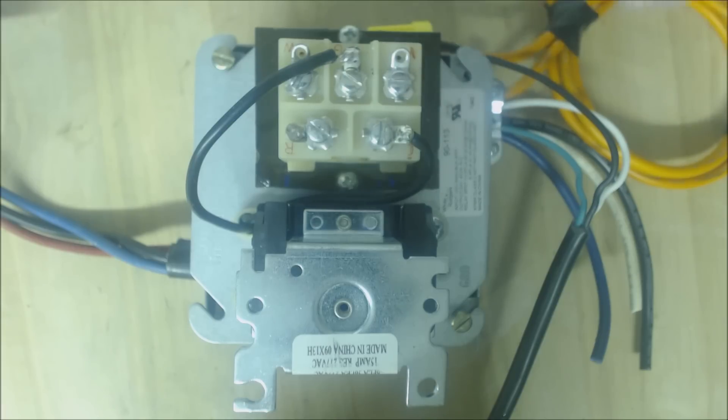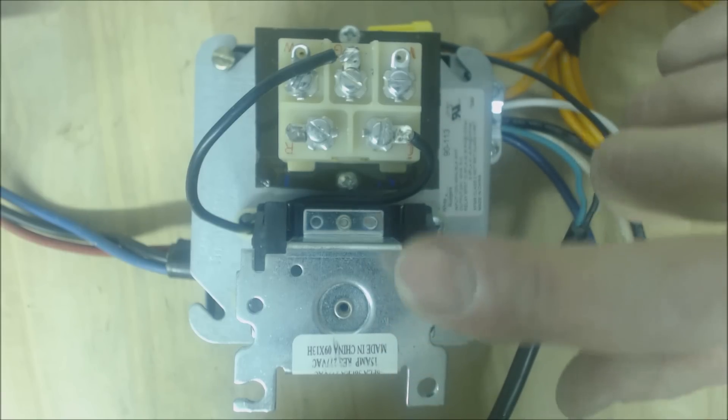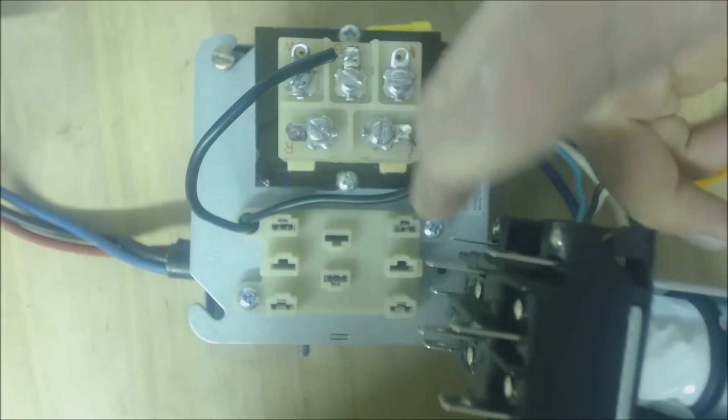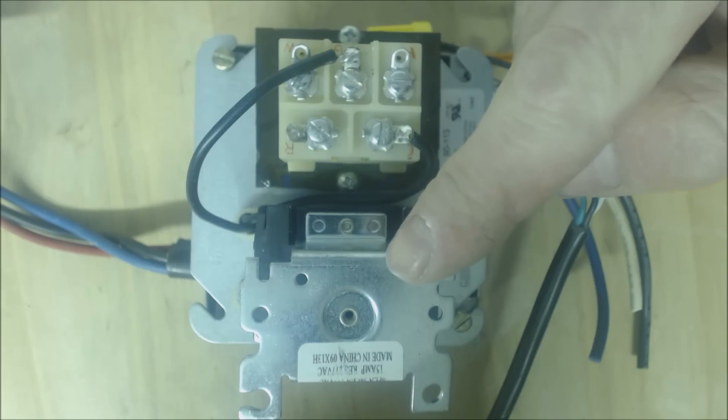This is the terminal block right here. So instead of having an IFC integrated furnace control board in earlier furnaces, this is what they used to use. This can be found in some boilers, it can be found in forced air gas furnaces. They're generally used to separate the heating cycle from the air conditioning and fan cycle. That's what the purpose of this is. So you have this relay right here — when it's powered by 24 volts it's just a general purpose relay that opens and closes contacts here. But this bypasses the fan limit control.